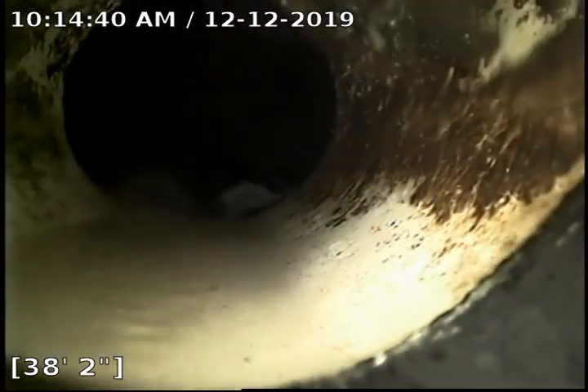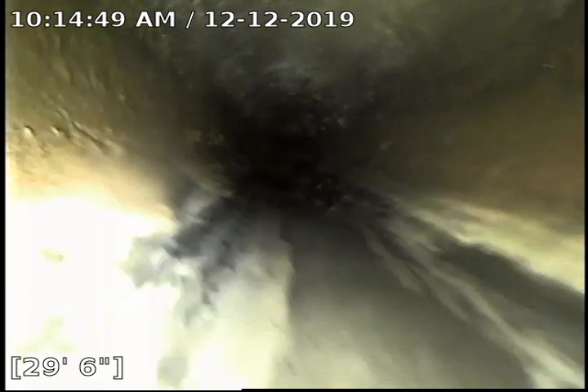We're going to see if we can push through this into the outlet. We're not going to be able to do it there, so we'll have to do it on another unit. But this is in the manhole — we're coming from concrete to 4 inch PVC back to 3 inch ABS. That concludes the sewer scope on this unit, which is 3412. We're going to pause the video and move to 3408.